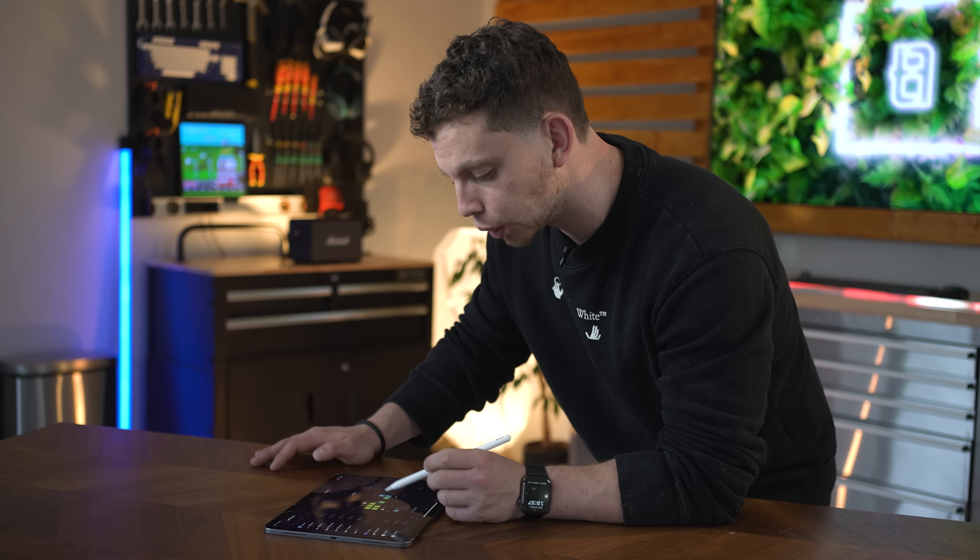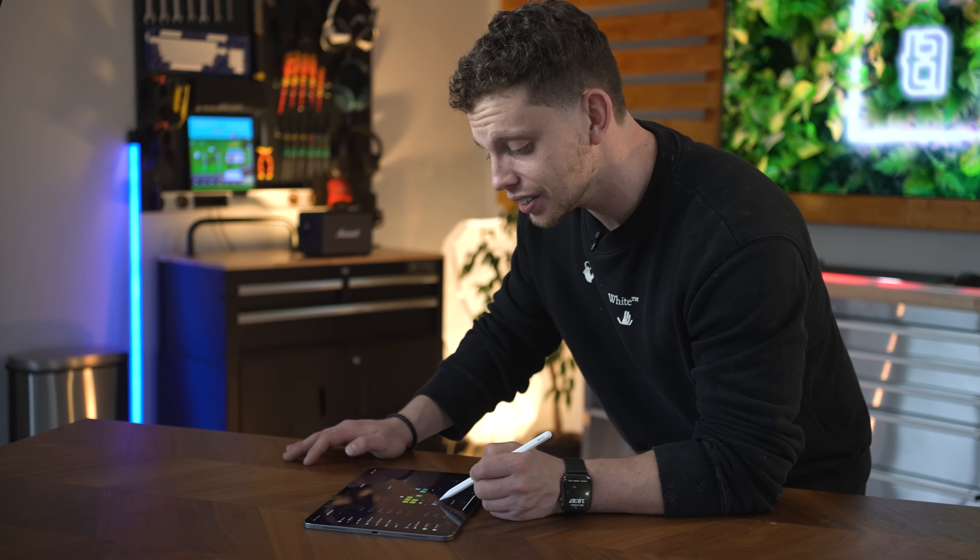This switch from the storage room I've now brought down here. It has two-and-a-half gig Ethernet ports with PoE and also SFP+, which — if you were paying attention at the start of the video — means 10 gig. I'm going to order another SFP+ cable, and this switch is going to connect to the Alta Labs switch up in the storage room, which then goes all the way back over to the house where the internet is. To prove that this is working, I've logged on to my UniFi software and we've got the front panel of the UDM. Clicking on port number 10, SFP, opens the dialog box showing 10 gigabits per second. This isn't megabits, this isn't one gigabit — this is 10 gigabits. Proper, proper future proof.